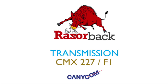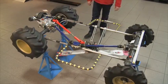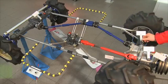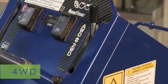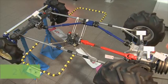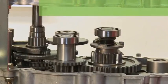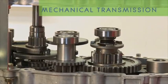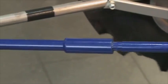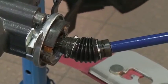The Razorback has a mechanically based dual range four wheel drive system that is coupled to an infinitely variable hydrostatic transmission. The mower can also be driven in two wheel drive. The mechanical drive train resembles a Land Cruiser or Patrol, with drive shafts from the gearbox to the centre of the mower, with universal joints through to the front axle.